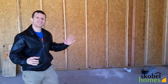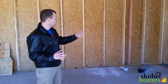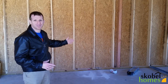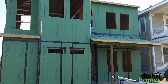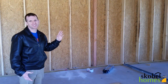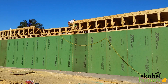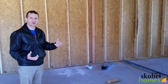As you can see here, this is the house where the exterior framing is fully complete. Before, the walls were kind of open and you could see through them. Now they've been sheathed with Zip OSB on the exterior walls. That's a kind of cladding — it makes the wall more secure so it doesn't wobble, and it gives it a solid finished surface. It's called sheathing. Some people use plywood; we use something called Zip OSB, which is the green material you'll notice. It's a waterproof OSB — a better product that we use.